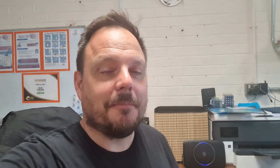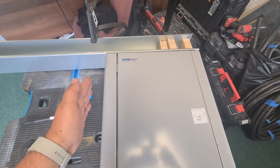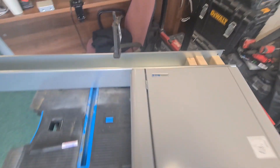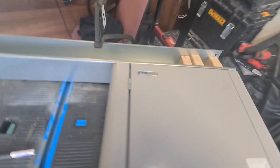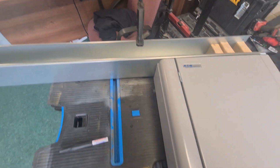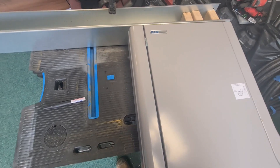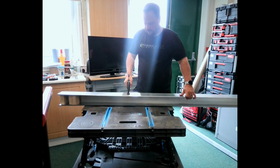Get involved in the comments, let me know what you think. Again, this probably isn't how they teach it in college anymore - I learned this a long long time ago and it's not something that's probably current with modern methods, but this is how I do it. The first thing to do with your trunking is to get a measurement for the distance of the board you're going to come down. If you're cutting your own corner, this will be your center line. I prefer to offer it up and then mark down the side where I want that center line to be.